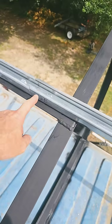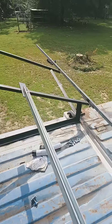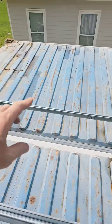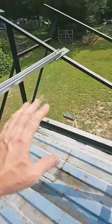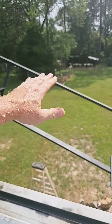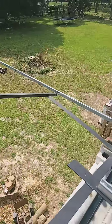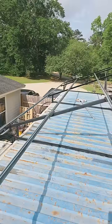We're using half-inch bolts two inches from the end of the unistrut. And because my shipping container is only 30 feet long — well, because I cut 10 feet off, this is the solar shed — we've added these little outriggers on either side to hold four more panels. So that's a total of eight hanging off, and from end to end it'll be 43 feet long.